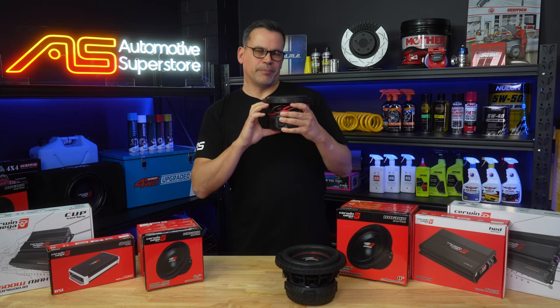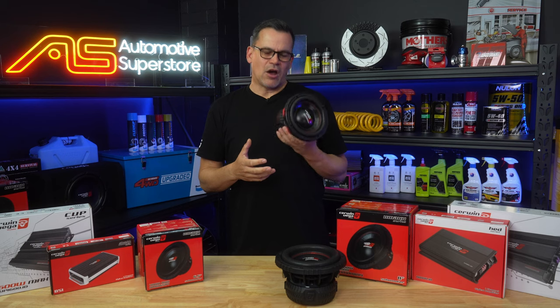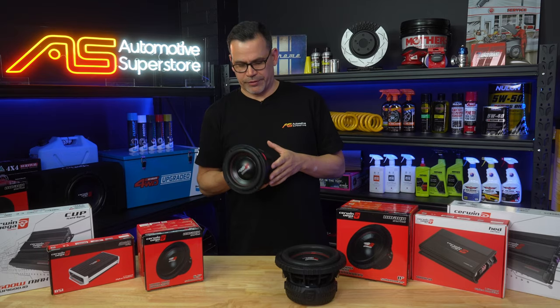It's the depth that's the problem. Sometimes even that plane's impossible, and so therefore you end up having to use a high excursion small diameter driver, and you've only got a very small enclosure volume to work with.